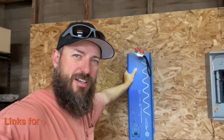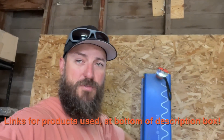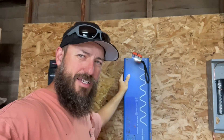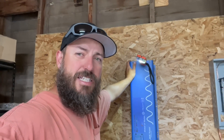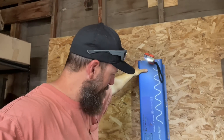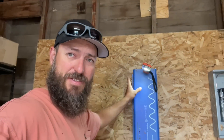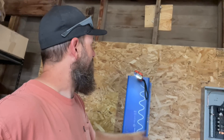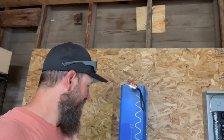Once the solar charges that massive battery bank up, this is our power inverter. This thing is capable of doing dual-phase 240-volt AC off of our 48-volt battery bank — DC to AC. This sucker is 6,000 watts nominal, but it has an 18,000 watt surge, so you can start motors, compressors, well pumps — important stuff to keep your house going in times of need. This guy is heavy, I think it's 85 pounds, and that's all we could do to get this mounted up here with about 10 screws on a stud.